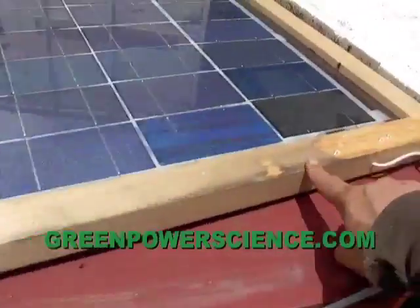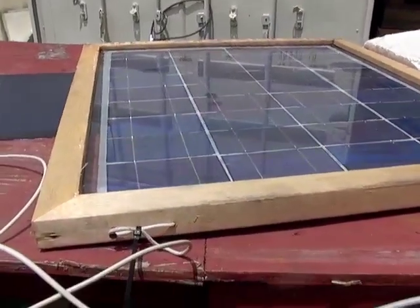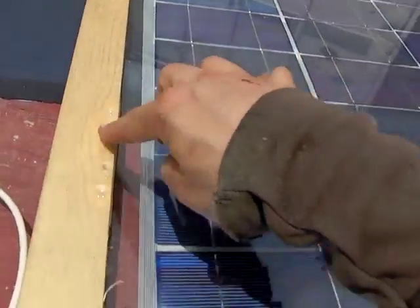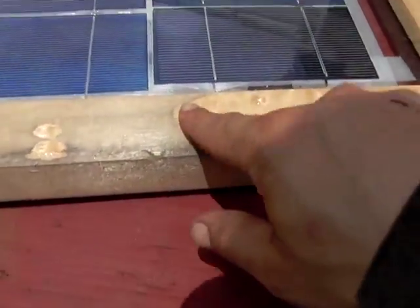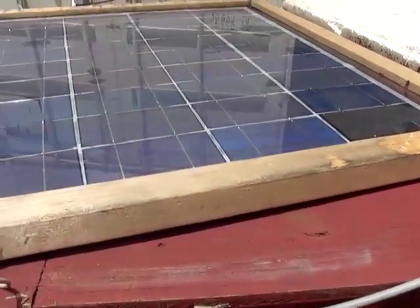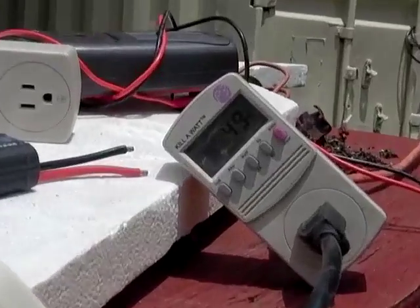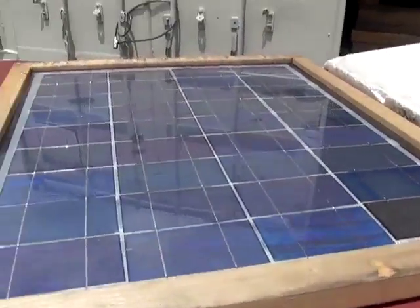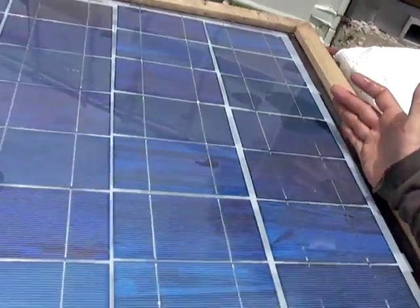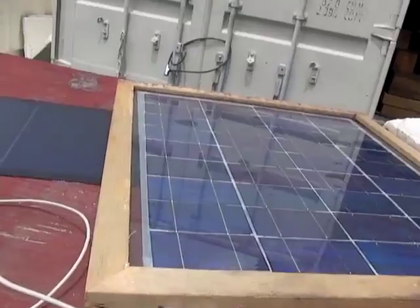This panel has been sitting in the rain. You can see the wood — got a little damage there. I didn't treat this wood because I wanted to show people that wood can get wet and not warp, not pop out of place, not crack and break your glass like some people say. If you look right here where the resin has spilled over, this clear spot is because the resin was there. So if you want to treat your wood, you should do that. What you want to do is put a clear varnish over this, preferably a nice white spray paint — it's going to protect the wood from some UV. We are bouncing around 49 to 50 watts, which is really good considering there are broken pieces and the spots where the resin came through. Doesn't really affect it much at all. If this does yellow, it is such a thin layer that the light's still going to come through pretty good, and that's all that you really care about. Let's just say 45 watts with this panel.